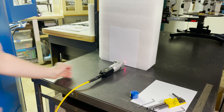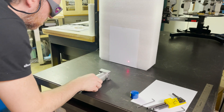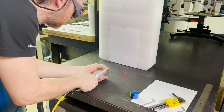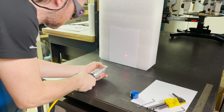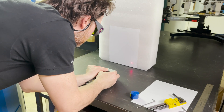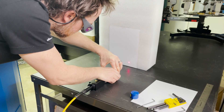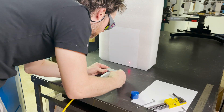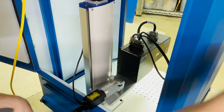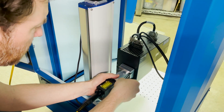The actual fiber laser beam didn't show up too well on camera, so for the sake of this video I'm just shining the red laser that's used for framing. The directions say to twist it until you get it centered vertically, and then you can slide the front piece side to side to get it centered horizontally. I fiddled with it until the laser beam looks centered in the crosshairs and then tightened it down. I removed the crosshair insert, inserted some alignment pins, and it's ready to install into the laser head.